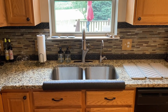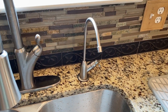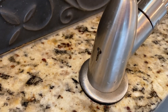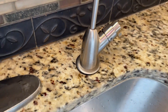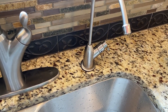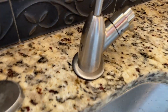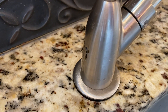Inside the kitchen now, and to the right of the main faucet there is our reverse osmosis faucet. On the side, as you can see, we have what's called an air gap. An air gap basically allows the system to properly drain the contaminated water that is filtered out throughout the filtration process and push it down the drain hose. The clean water goes to the storage tank and that dirty water flows down the black drain hose and into your plumbing and out. This air gap makes some crackling sounds and that's basically the sound that this specific faucet makes.